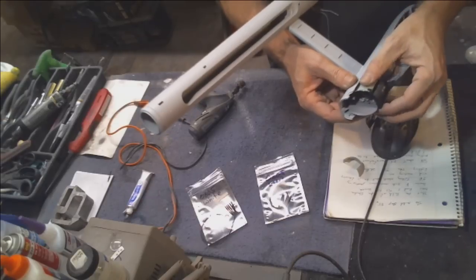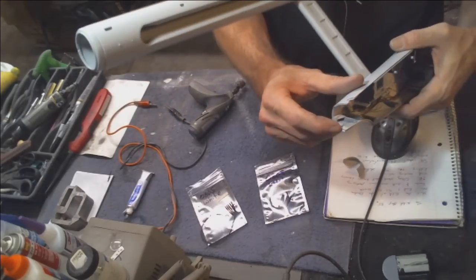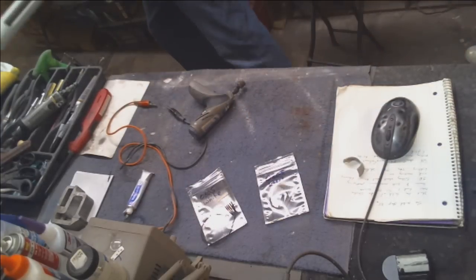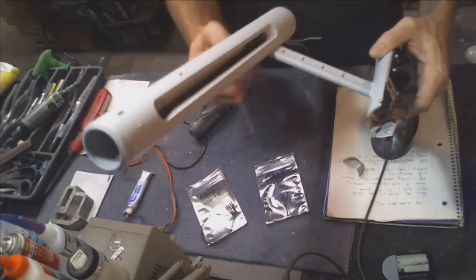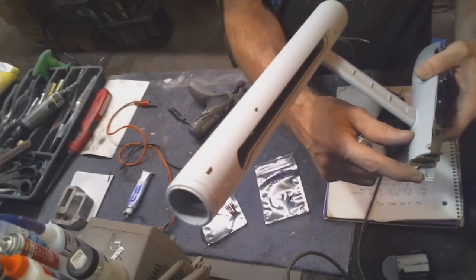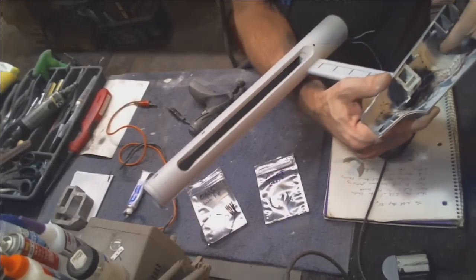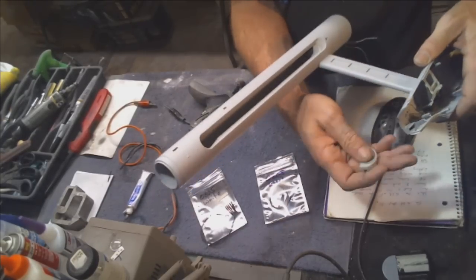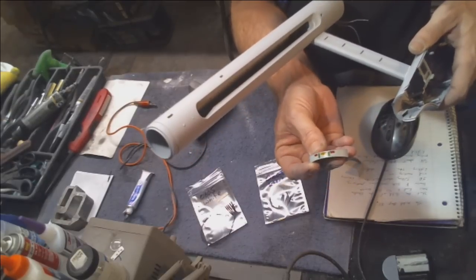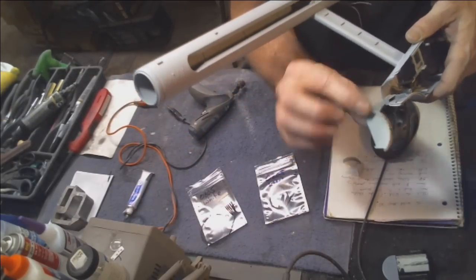And then here, finally, what I'm going to show you is that on each side here on the floor, just below, you can see that I've got, let me grab one more little piece here. I've got a standard white 0805 SMD mounted right here, and the same thing on the other side of the hull. That's been already tied into our main wiring harness here, so it's going to light up whenever the power is on. That's to light up our fan tail here. We have these little approach lights that go underneath the open shuttle bay doors, and that's to light this up. Now, this is the opaque part.